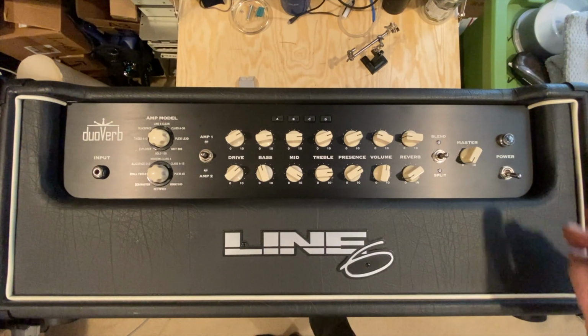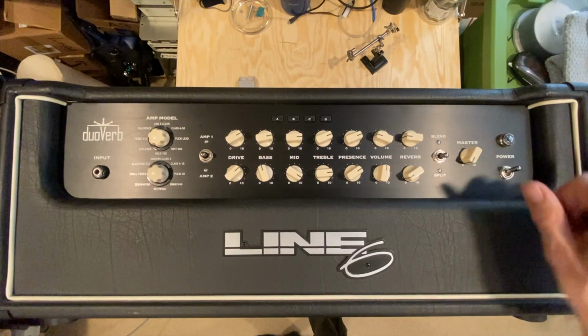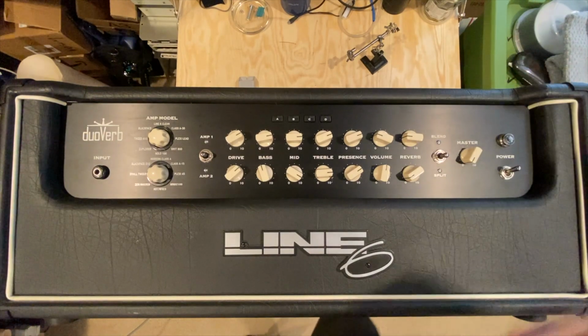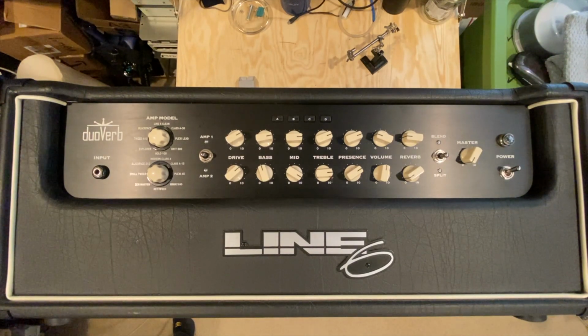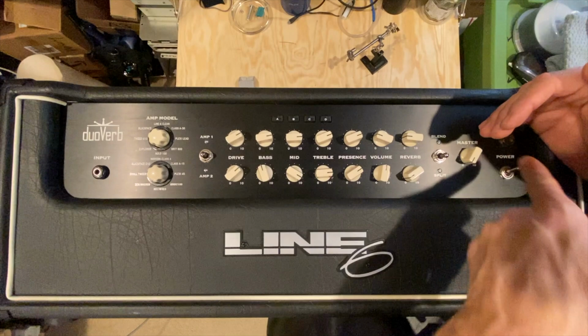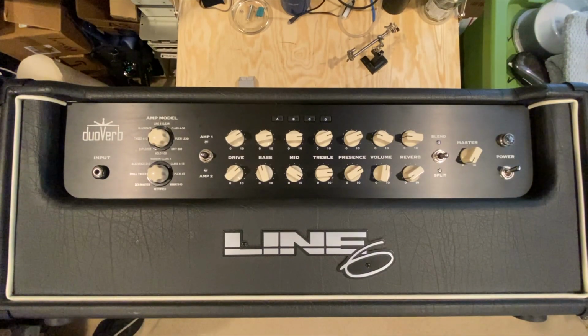Better safe than sorry. So I'm going to turn on the power switch here, and I'm going to start turning up my variac. Let's see, we're at 50 volts, 60 volts. See if we start to get any activity. Nothing on my bulbs yet, so that's good. 70 volts. Let me see, can I see anything happening with any lights? Nothing yet. Keep going here. We're at 94, 98, 100 volts. Let's see if we have anything yet. Oh, I got a little bit of a flicker happening inside that, 100 volts. Let's keep going. Let me try to get her up to 110.